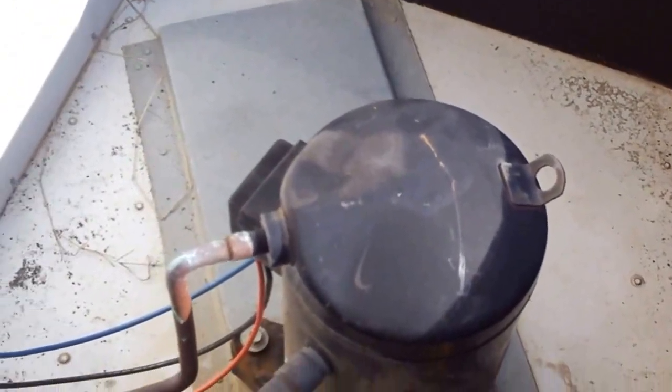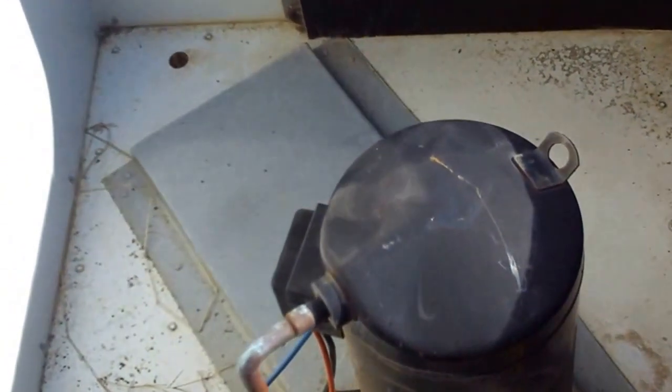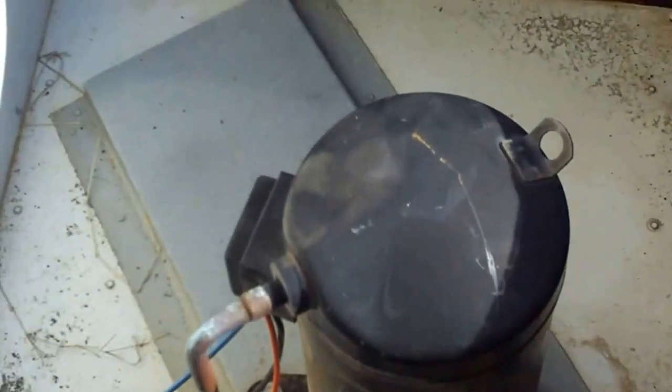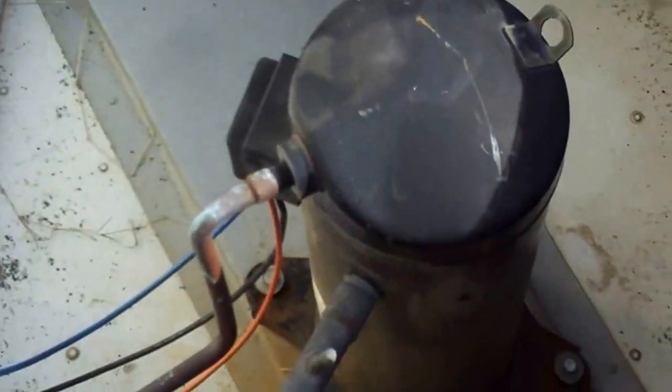Fan motor was bad, capacitor was bad, contactor was bad. Top off, had to carry the top and all with me back to the house so I could break it loose. It got late and that thing was rusted on. Been on there for 14 years, so I just carried it on back. Storm was coming. But brought it back out here today.